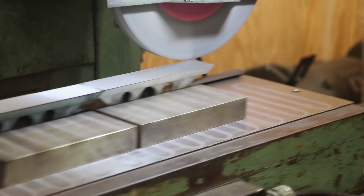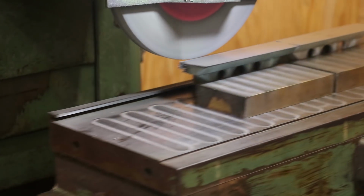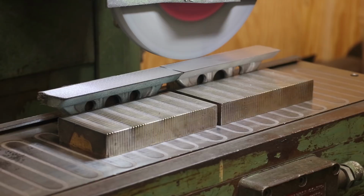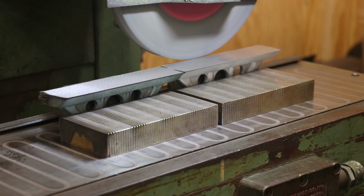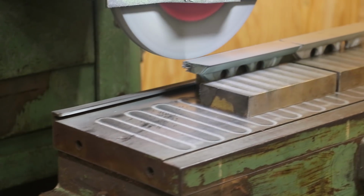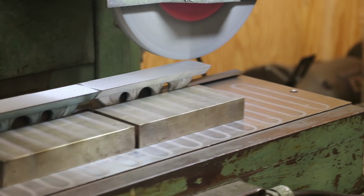So what I'm gonna do now is I'm gonna give it again that probably just a 1/2 thou, and I'm gonna put it in the slow speed. And let's come across this thing.